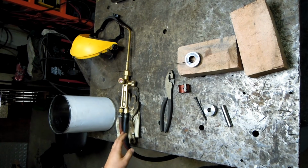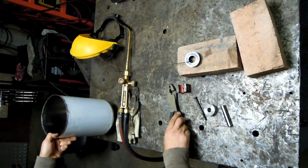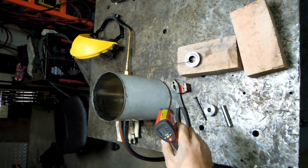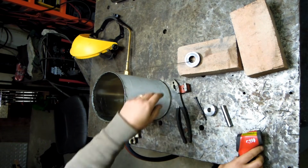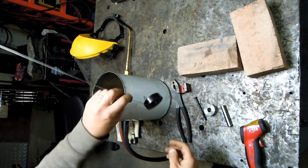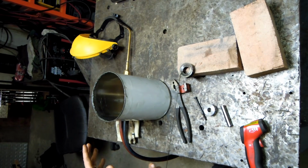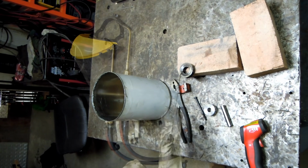I've got all my protective equipment out, I got the apron on, I've got some oil here. This may just be superstition, but the oil's at room temperature here, which is about 17 degrees. So, 17 degrees, what I'm going to do is just heat up a piece of scrap. You can see it's done this before. Dunk it in the oil and that'll just knock some of that edge off of it.